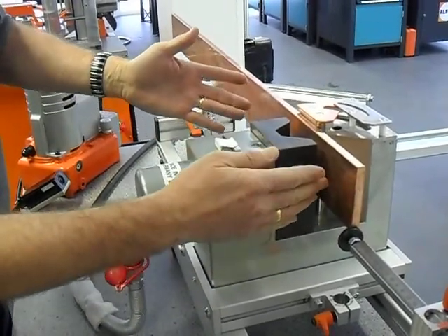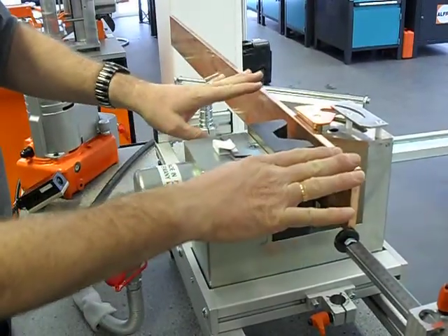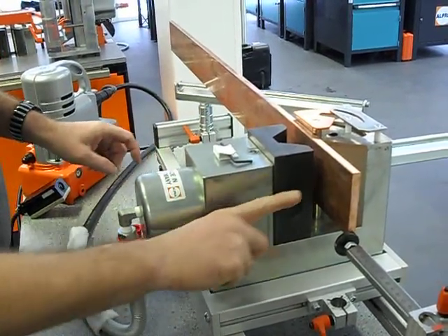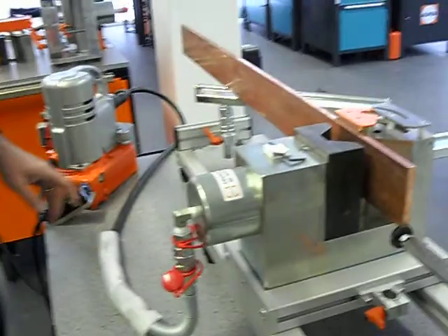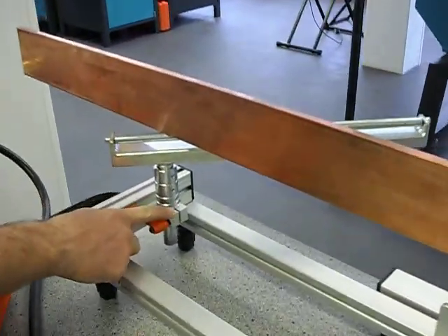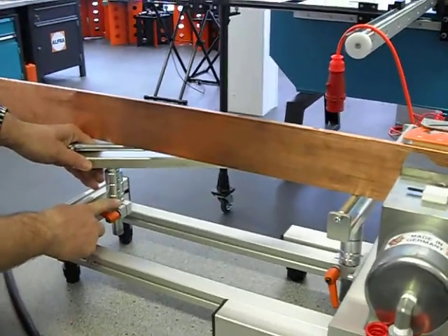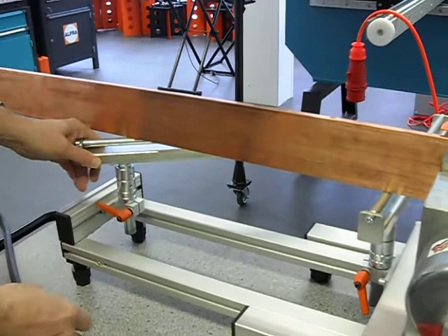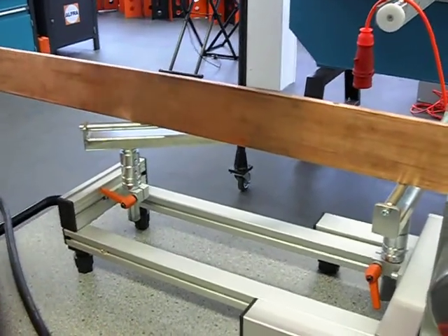So we must now adjust the height of the bar so it goes down a bit, so we have the piston power in the middle of the bar. The way we do that adjustment is with the arm supports. In this case, where we have a long bar, we have movable arms that can be moved along the track for the length of the bar and can also be swiveled.